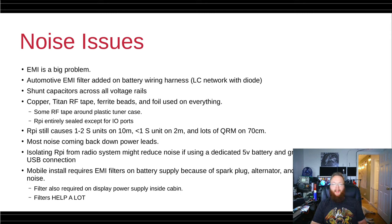I have tried some isolation techniques: there's an EMI filter in the bag, and I had an optocoupler for the USB connection to the radio. That all seemed to help a little bit but didn't entirely resolve the issue. For the mobile install, I definitely recommend EMI filters on the battery — they really do help a lot. The Raspberry Pi, even in an aluminum case, I wrapped entirely in copper tape, did the same for as many cables as I could, put ferrite beads on all connections, and tried to RF-seal everything as much as possible. Wrapping the Pi in copper tape actually helped a lot, but there's still some noise — it's hard to isolate exactly where it's coming from at this point.